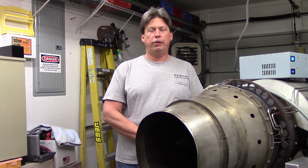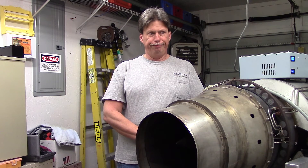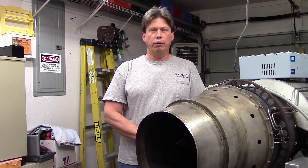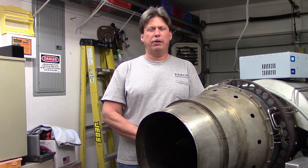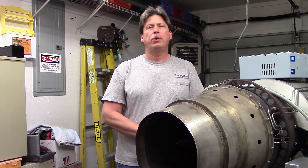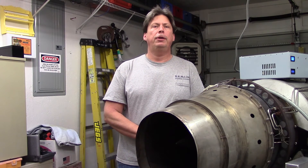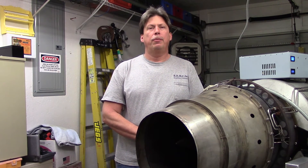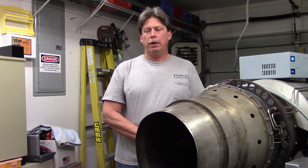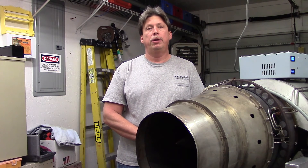This has an annular combustor, so maybe there's erosion there causing extra heat concentrated in that particular location — don't know. Once I remove the nozzle, we'll be able to see what's in front of it toward the front of the engine. While it's removed, we'll look further inside and check for other problems. Everything else is in pretty good shape, so if I can get that repaired, this thing will be ready to go.